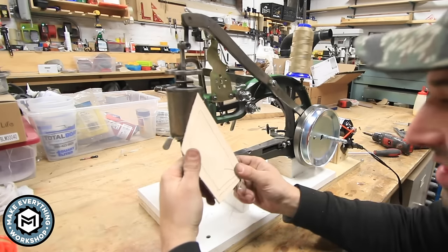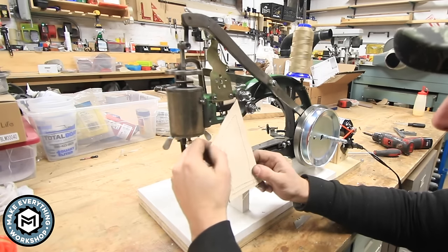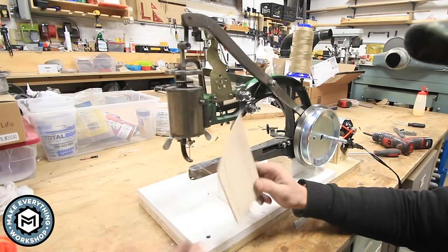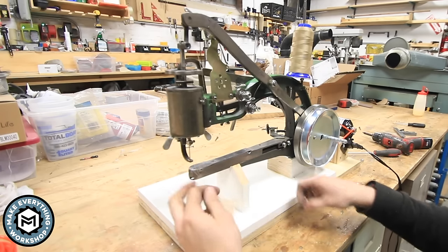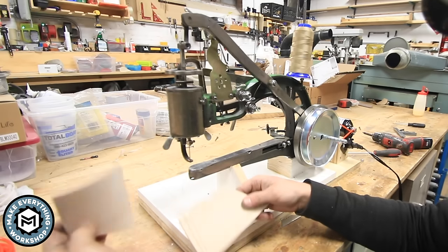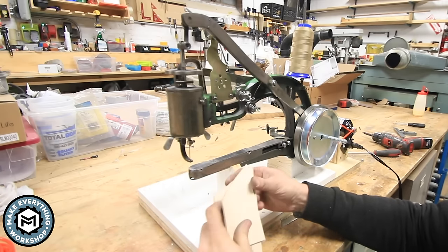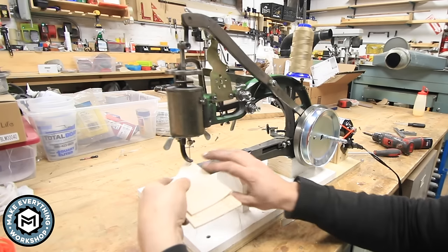Take a look. So, like I said, it's aggressive, and the foot on this machine is notably pretty harsh on your leather if you don't soften it up. Now, mine's really sharp. I've been meaning to sort of deburr it, but I just blazed around that piece pretty quickly and with really good control. What I noticed is that this thing kind of wants to wander, so maybe I'll tighten this up a little bit, but let's try and stitch two pieces together and go around the border, make a little pouch or whatever, and see how it does.